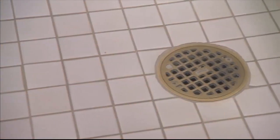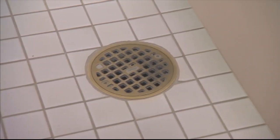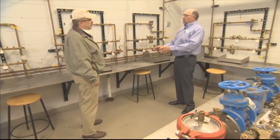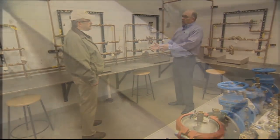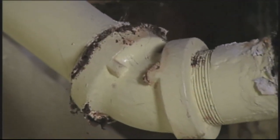We also got to be careful that the sewers are also dried up. The traps are dried. So if you have a sink or a shower or something that hasn't been run for a while, those traps might be evaporated too, and you got sewer gas coming in. So all those things have to be flushed and filled and put back in operation. And with the sewer lines drying out, some of the stuff in the sewer pipes is also dried up, and as it gets wet again, it may lead to more clogging and different issues in the sewer itself.